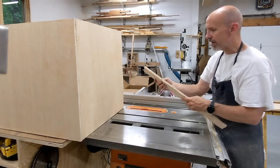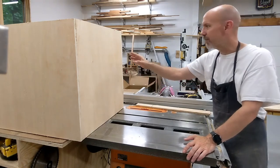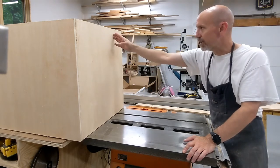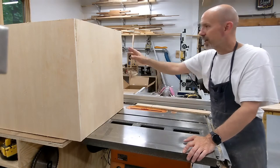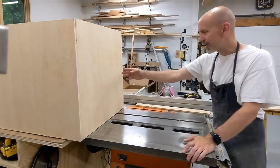It's a pretty slick way to make a box and make sure everything lines up. A couple of things when constructing it: make sure you know where all your screws are. This was pocket hole joinery, so everything inside is pocket hole screwed. I marked the distance and put the screws in so I'm not going to hit them with the table saw. Also, once you close the box up it's really hard to tell which part is up and which is down, so make sure you mark top and bottom so you know which side you're cutting.